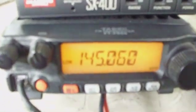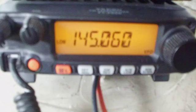This is now connected to the SWR meter. Let's check the SWR — first, let's check at low power output. Switch to the calibrate position — this is 5 watts. Calibrate the SWR: press the PTT and set the connection.